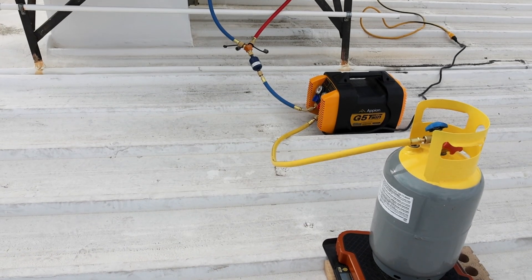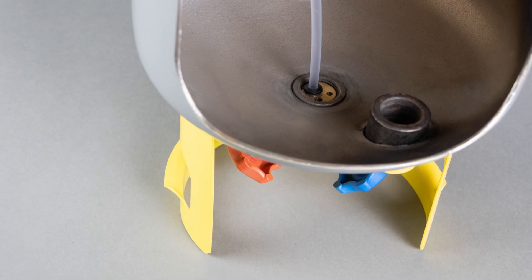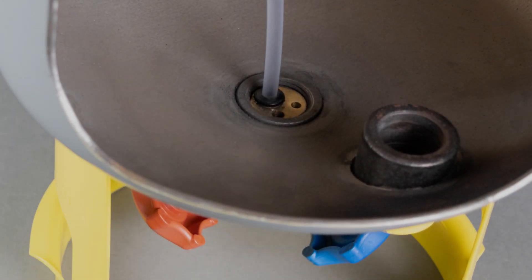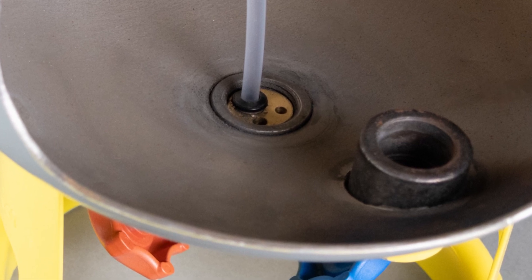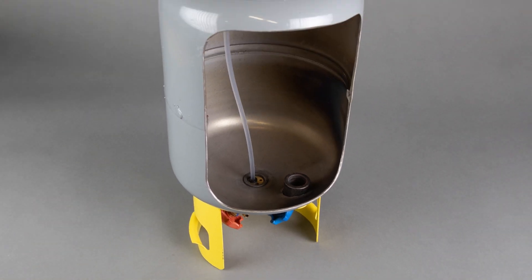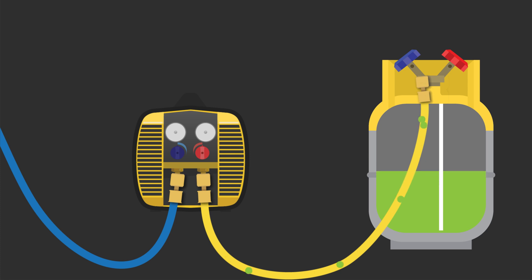Using the vapor port of a recovery cylinder with the valve fully open is crucial during direct refrigerant recovery for several reasons. Primarily, the vapor port is the least restricted port, allowing refrigerant to flow freely into the full volume of the cylinder. This less restrictive flow contrasts greatly with the liquid port, which leads into a narrow dip tube that significantly restricts flow. This restriction can lead to liquid hammering, a phenomenon where rapid changes in liquid flow cause pressure surges that are often heard as a knocking from the recovery machine. Such surges risk damaging the recovery machine and impede the flow of refrigerant significantly. Therefore, utilizing the vapor port with the valve fully open ensures a smoother, safer, and more efficient recovery process.